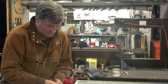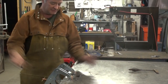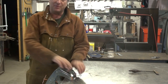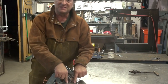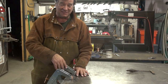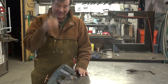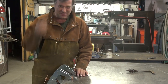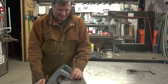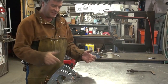What if you don't have a cant twist? Well, there's lots of different clamps you can use. If you have to, you could just hold it down with your hand. You could weld it to the table — not very hard, just a little tack on the corner here and there to hold everything still, then come back and grind off your little tack welds and take your piece off. You could get a brick. There's all kinds of different ways — use your imagination. These are the tools I have; how can I make them do what I need? That's part of the fun, making tools do something other than what they're supposed to do.